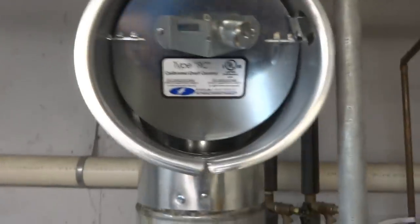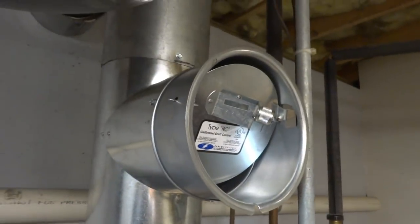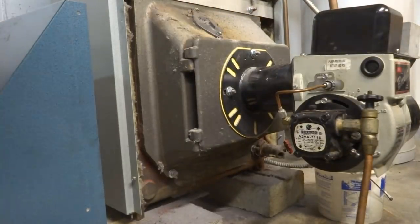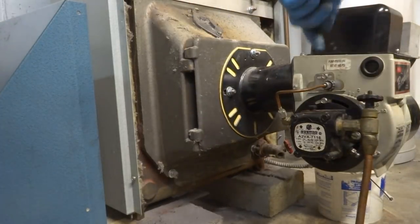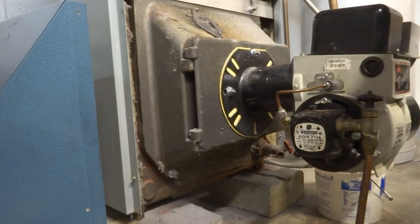That's pretty good right there — between one and two is what we want. That's a lot better than four. Right there, that's what we're going to leave it. See how it's sucking air in there and stopping the draft? The draft over the fire was too much before, so we're letting some air in here to slow it down. Before you were getting too much draft over the fire, sucking the heat right out of there. Now I've put that damper in so we can adjust the flow over the fire to the proper amount — that's what we want.